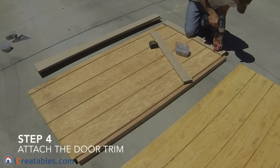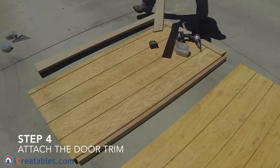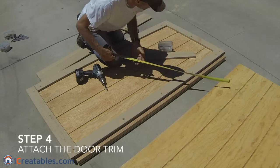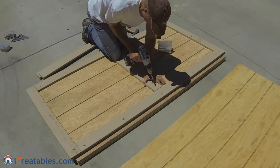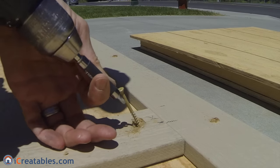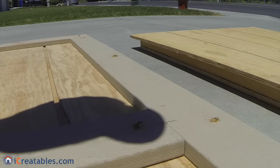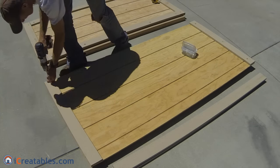The fourth step is to attach the door trim pieces. Cut out the trim pieces and check that they will fit together on the front of the doors. Make sure that the screws are located so that they anchor into the door rails behind the siding. Use a screw at each end of each trim piece and then spaced evenly at 12 to 16 inches apart. Any trim pieces in the center of the door panel will need to have their screws angled so that they hit the inner door rail. Install the trim on both doors.